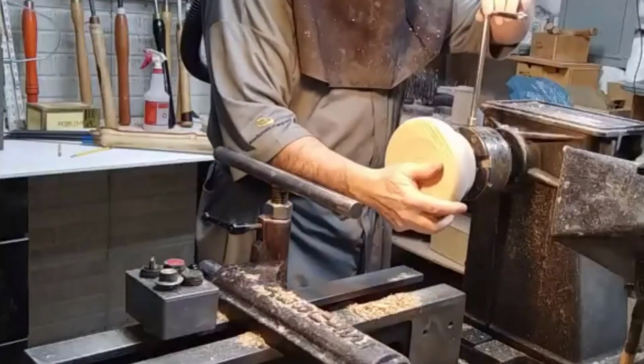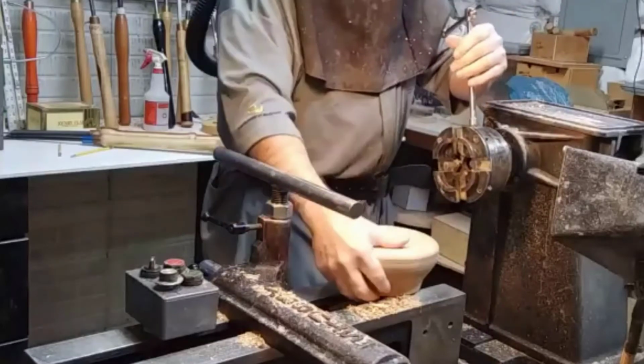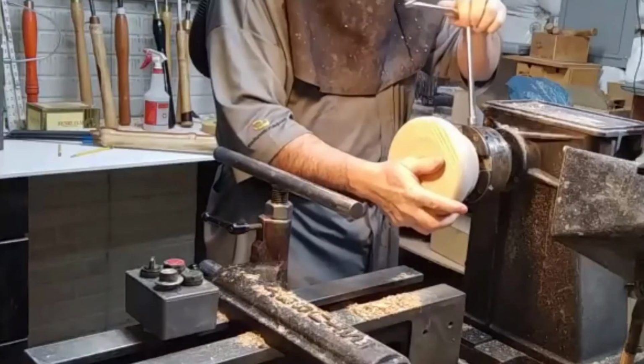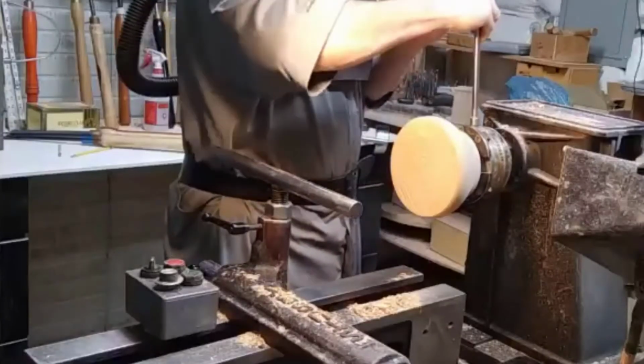The cutting tips, the Hunter carbides, are meant to be used with the cutter slanted at like 30 degrees off of flat. Well, I got that Trent Bosch system and I was using it straight and I was having a hard time. So I put it on a slight angle and it cut better. Yes. Yeah. He teaches that.